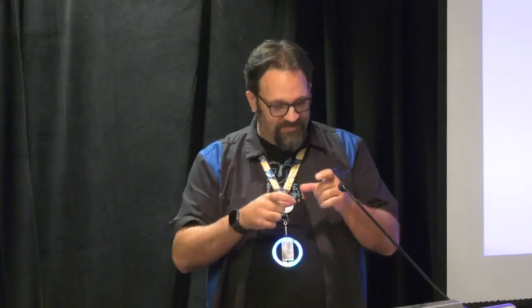One way to handle that is by attenuating the signal. You can stick in an attenuator, which is just three resistors in a particular orientation, and it makes the signal weaker. When you're far away and already have a weak signal, you don't bother with an attenuator. But when you get close and inside that circle, you start adding attenuation, and that works great because it shrinks your circle.